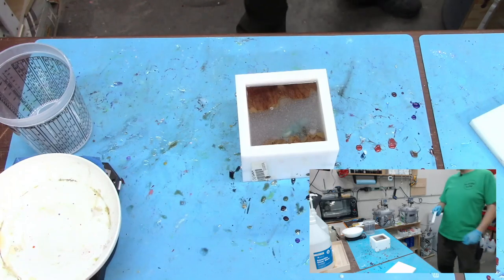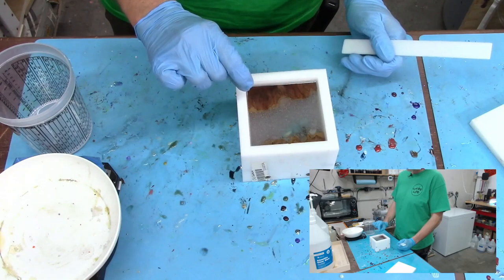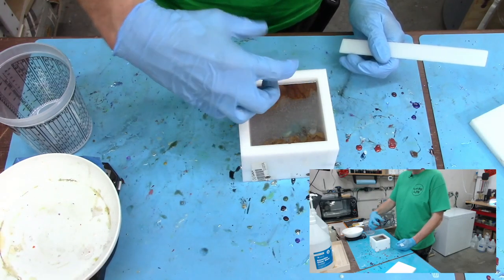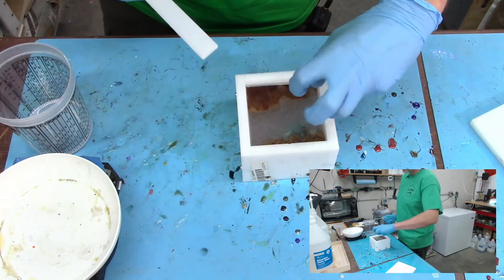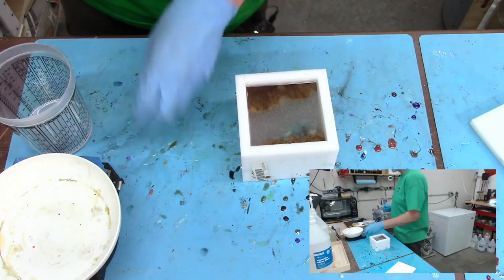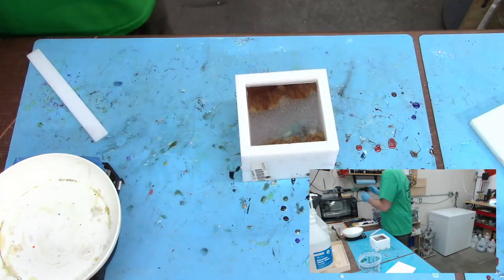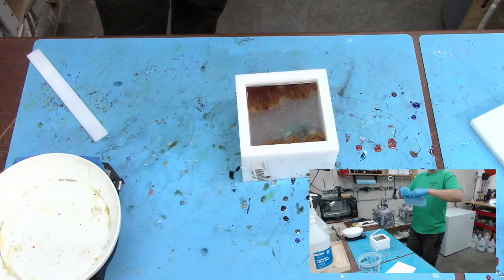That's another issue with pressure. The top can have bubbles because half of it's exposed, right? The way pressure works, it'll collapse an air bubble while it's under pressure, but the minute you release the pressure, it's going to grow right back. So if there's half a bubble on the surface, you'll notice little pits here and there. That was a bubble that was halfway on the surface, and when you release the pressure, it came back, basically. I believe that's the scientific way of looking at it.